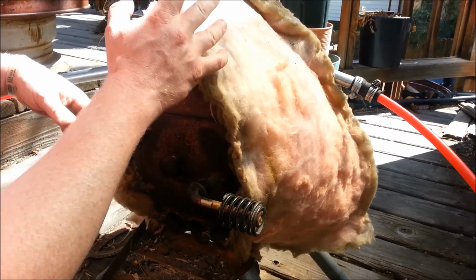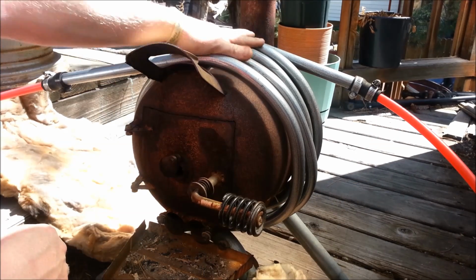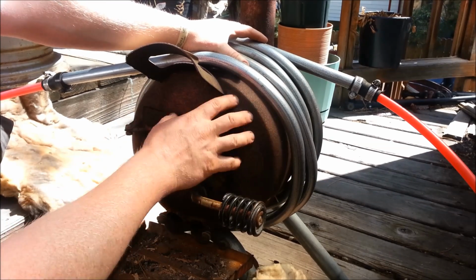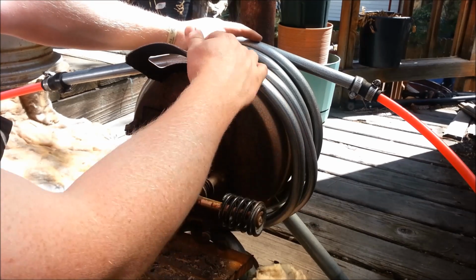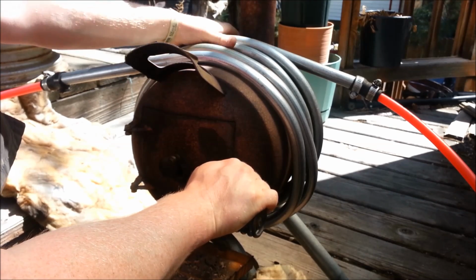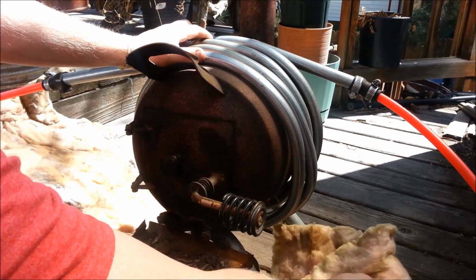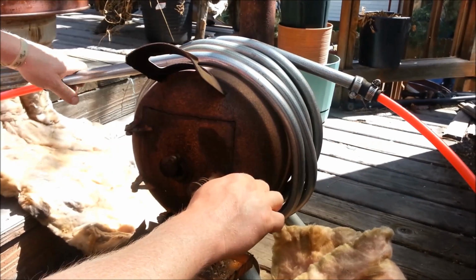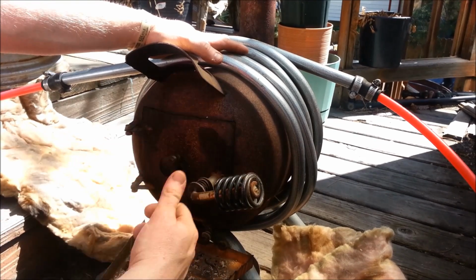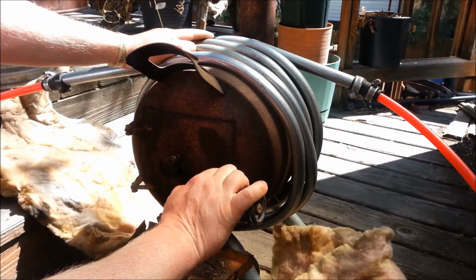First we'll start out with what produces the heat, and it's just insulation, but what I have is an old propane tank that I turned into a potbelly type wood stove, and I actually have a video on that, and I'll put a link below. But I wrapped electrical conduit around the entire outside, and that flows my water. The insulation just keeps the heat in, helps distribute the heat to it. You'll see I'll have a line coming in here, and it comes out over here. And put your wood in, put your log in, let it burn. Water flows in, around 6 times, and it heats itself up.